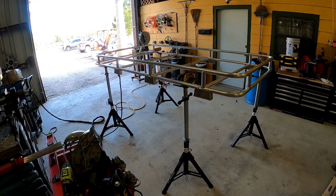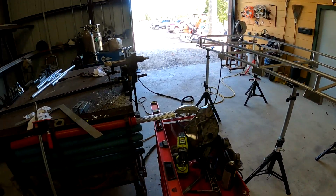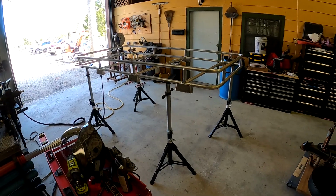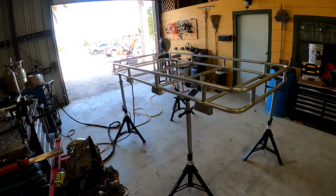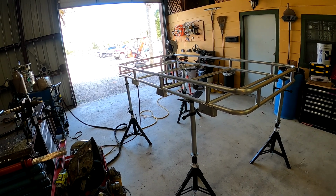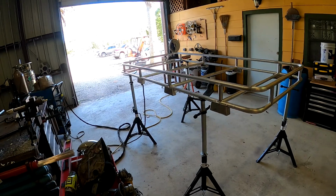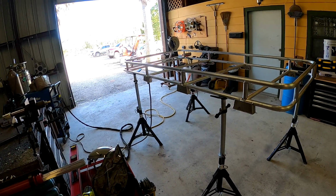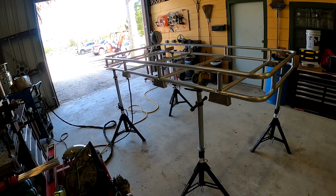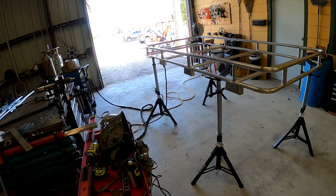You fast forward it all anyway, so I'm just kind of showing y'all as I go. Like I try to explain the notching, I try to explain the bending, which come to find out, when I showed y'all on that bending, it was actually making it 1/4 inch long. So if you wanted the 5'2", I needed to go 5'1 3/4", because it grows 1/4. So I corrected that after that first one that I measured up. So just keep that in mind.